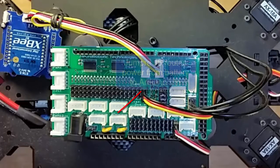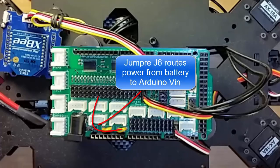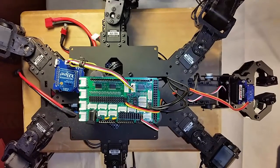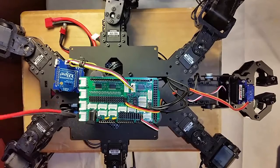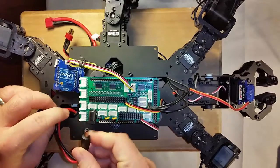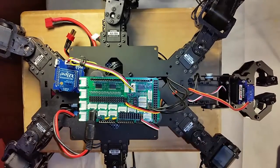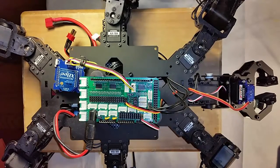Next, let's connect the pressure sensor. Plug it into the AD11 column on the three-pin analog header row. Again, make sure that you put the black wire up top that's labeled near ground. Finally, let's plug in the power cable to the shield. You should make sure that Jumper J6 is on so that the battery will power both the shield and the Arduino. Finally, let's connect the USB cable from the computer into the programming port of the Arduino so that we can download our sketch.